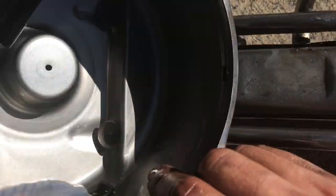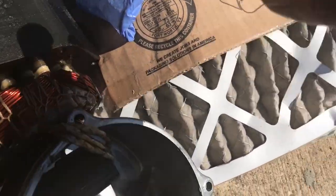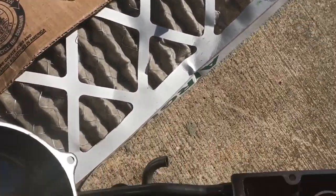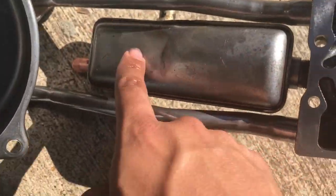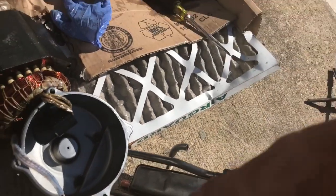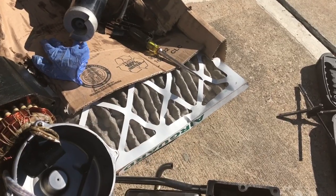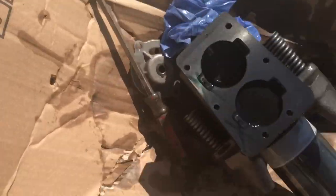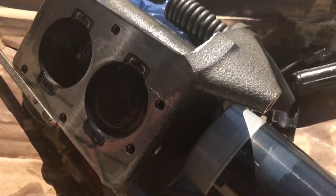If you can see. I'll take a picture of it, but anyways, goes down to the outside of the head and then into the valve plate, into the valve reed, whenever the compressor goes down, and then when it goes up, gets discharged up through here. Through the muffler, through the discharge line, wraps around the bottom of the compressor, kind of heats up the oil too as it's running. Yeah, that's it.